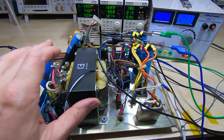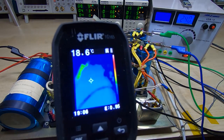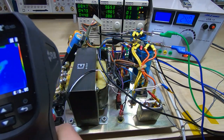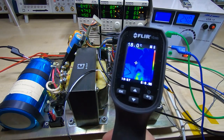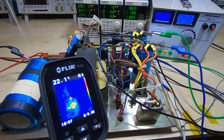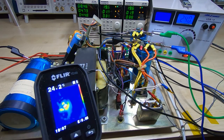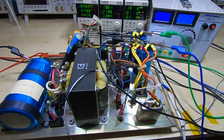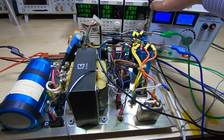It's been running at this load for about an hour and a half. Still nothing's getting particularly hot — the resistors are still hot, the capacitors are still cold. The transformer's heated up a little but not too bad. The heat sink on the smaller board has got fairly warm at around 25-30 degrees. The large capacitor is still cold and not warming up at all. The bridge rectifiers on the back chassis have got slightly warm — one is glowing a little on the thermal camera, getting up to about 25 degrees. It's bolted to the back panel which is a very thick piece of metal with a huge thermal mass. I'll now increase these to 5 amps for the two rails and 10 amps for the lower voltage.